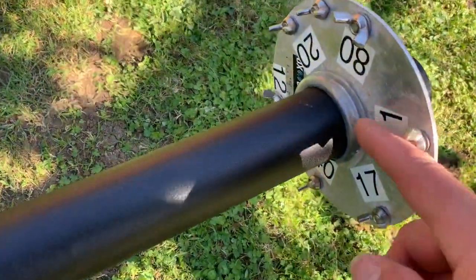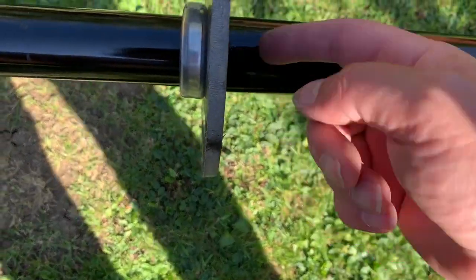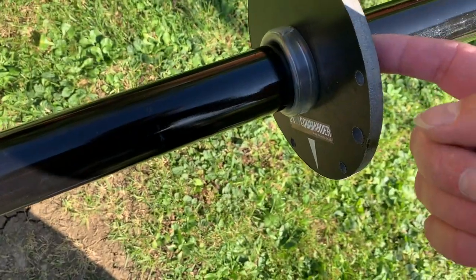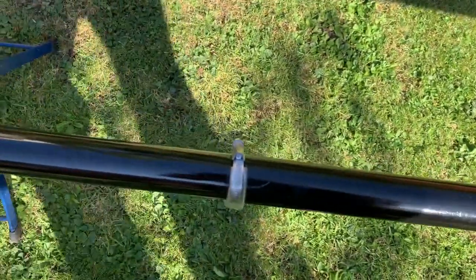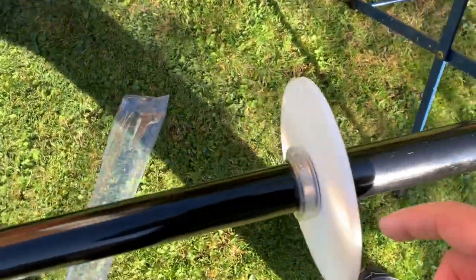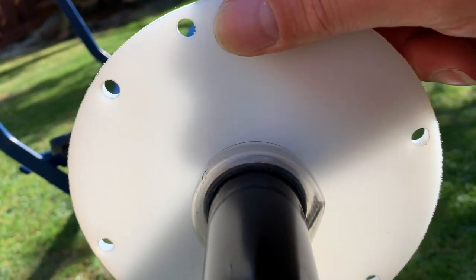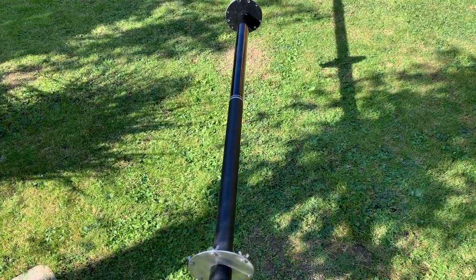Plate, Jubilee clip — the plate fits because it seems to be milled correctly. Jubilee clip, and that's to stop the tube from falling, not to stop the plate from raising or going down — that one is relatively free floating. Jubilee clip again on the smaller of the pipes, then the spacer which is held reasonably hard but will still turn as you can see. There you go — you can still turn it. Time to put the elements on now.